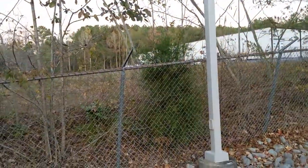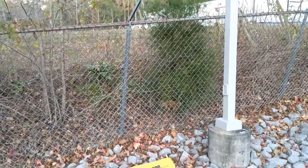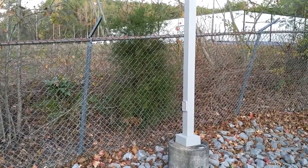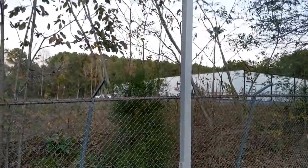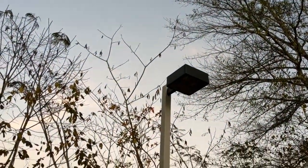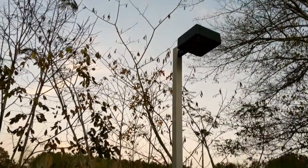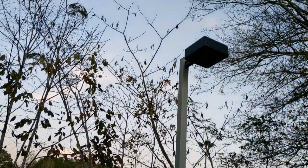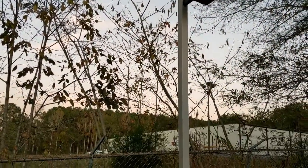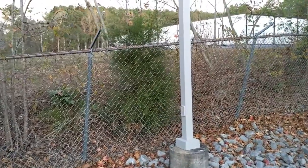Here's the situation. I've got an access panel here. I opened it up, but the wires aren't quite long enough for me to clamp, so I can't make a direct connection. There's also a photocell at the top of this light, and it makes or breaks the connection to the light. Right now it's off, and that means the wires going up the light pole are essentially a dead end. That makes it really tough to get any signal on this wire, particularly at low frequencies.